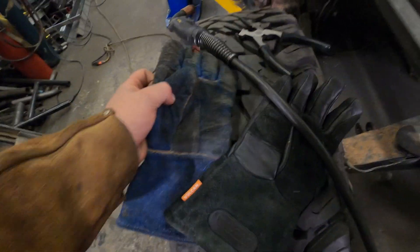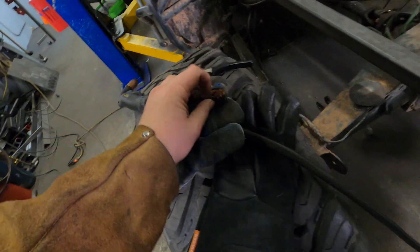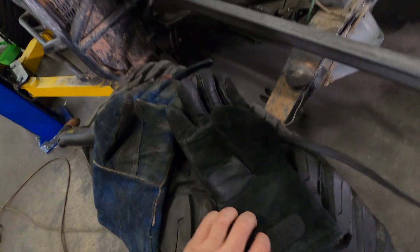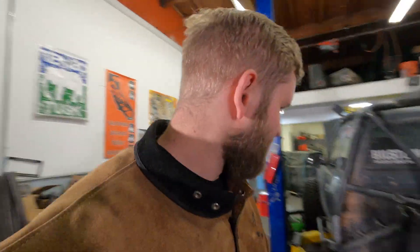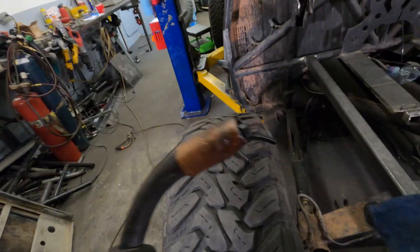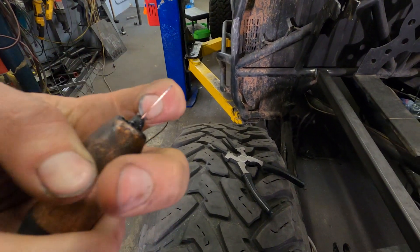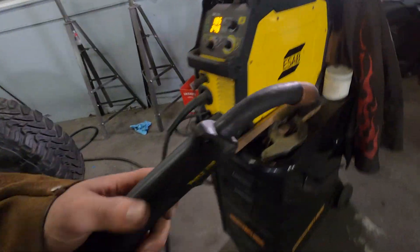When I'm doing production welding, with my left hand I'll wear one of these big stick welding gloves — a little thicker, you shouldn't have one with holes in it. On my right hand, this is a thinner MIG glove from Harbor Freight's fancy line of tools. I have a lot of their fancy line and honestly they're pretty good — just don't tell anyone with the expensive race trucks. One of the first things I'll do is clip the end of this tip off — you can see you've actually changed the composition of that piece of wire right there. I'll make sure everything's tight because this gun breaks constantly.